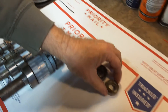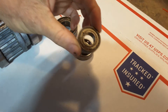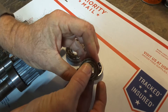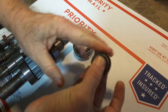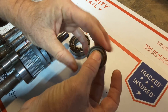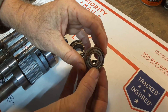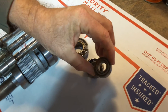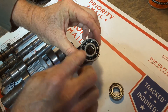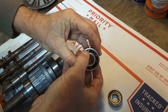The next smallest is the quill bearing — the single bearing quill shown here. All bearings: if you see grease sticking out the sides of it, if you see rust, that's bad. This one here really feels crunchy inside — the grease has dried up, then the ball bearings inside get rusty. It's just a downhill thing. If your bearings are more than 15 years old, you probably need new bearings. Sometimes you see disintegration like this — the outer dust shield is coming off on one side and it's already gone on the other.